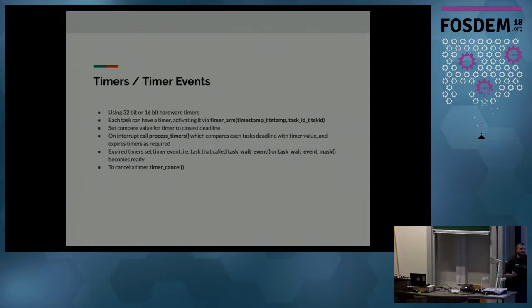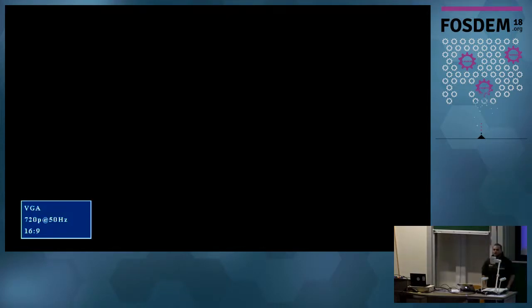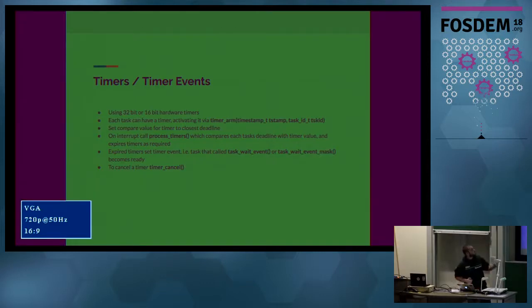I think FreeRTOS is more generic. This one was a good choice for me because it was basically meant to be used for what I needed. I mean, FreeRTOS has fancier mutexes, to my understanding. For example, they do priority inheritance. The mutexes here don't. You could create bad situations if you're not careful. But this one seems to be very well tailored to board level control for fan control or LEDs. No, I hadn't compared it, no.